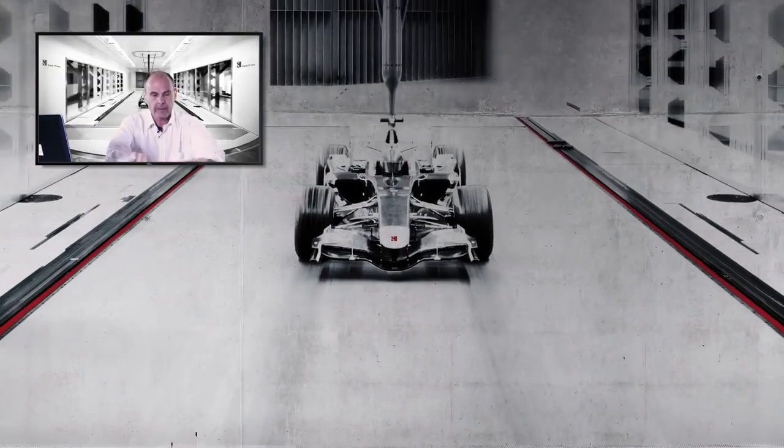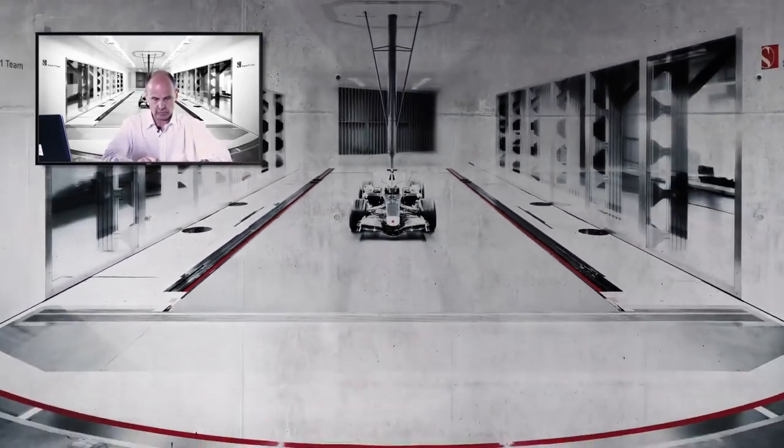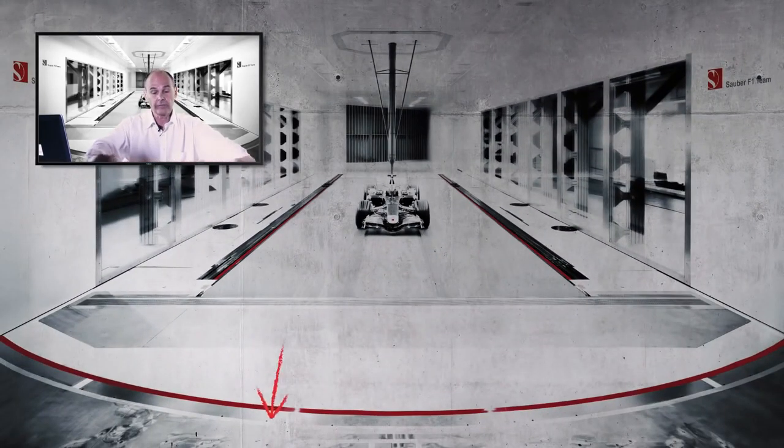There are lots of ways, but a simple way would be to create a step, if you like, near the leading edge of the working section and suck off at exactly the right speed any air that is moving more slowly than the air in the free stream.